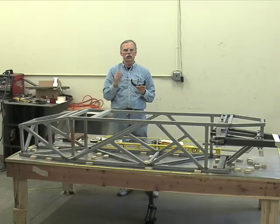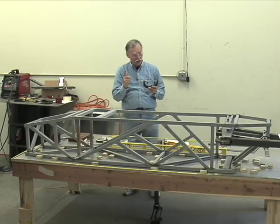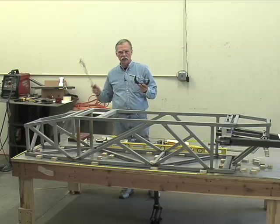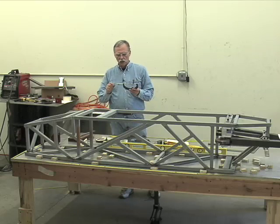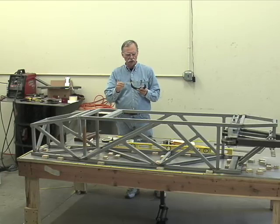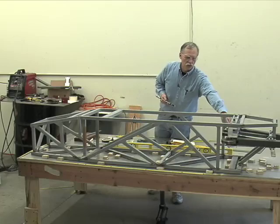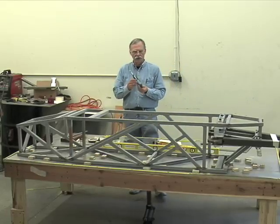It gives them accuracy of 1/10,000ths of an inch. That's one more decimal point accurate than these, one order of magnitude more accurate, as a micrometer. And you use these mainly on pump shafts, crankshafts, things that require extreme precision. Probably not on this, but definitely on these precision bearings for measuring the holes and everything, because those are built to very high accuracy.